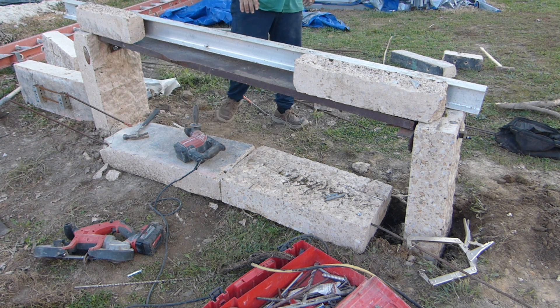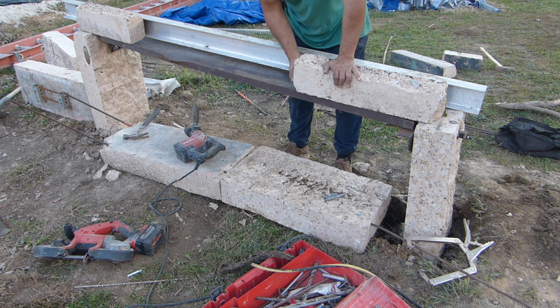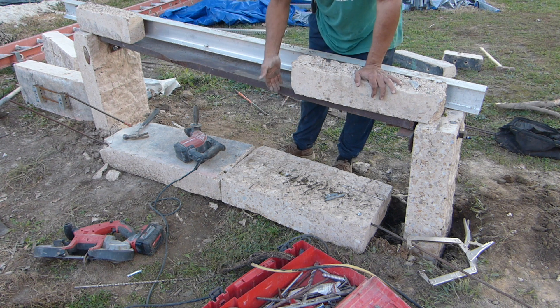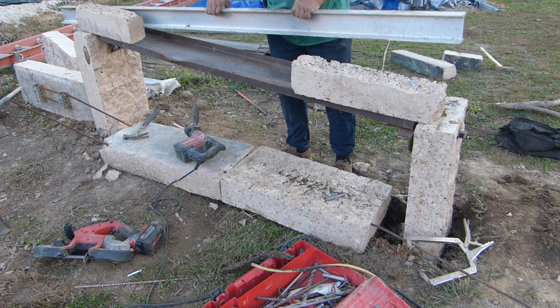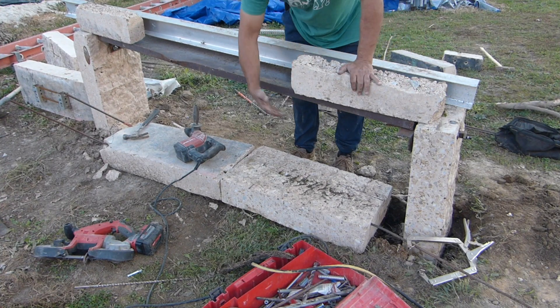As you can see, these aren't even connected — yet it's not going down — because you've now reinforced it with steel. It would be a beam like this. So you see how conceptually this works: there's your column, support ledger, underside of it, grout here. You don't have to make this perfectly even with there — it can come up short and you would grout it, and it would then transfer the load.